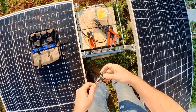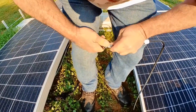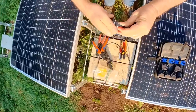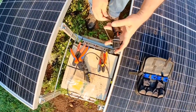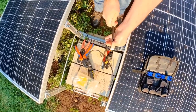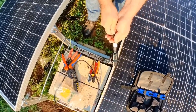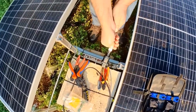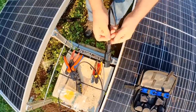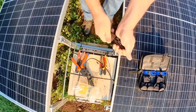Pop those in there, push them until they click. Give it a good pull — that doesn't come apart. This is a watertight seal — push that up in there. You never want to have your wires actually sticking out; you want this over the insulation of the Q-Cable, all seated in there. Then crank this tight.